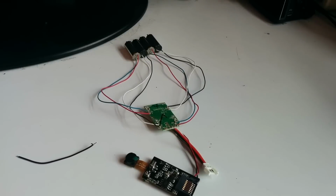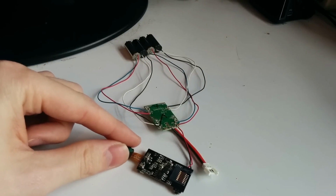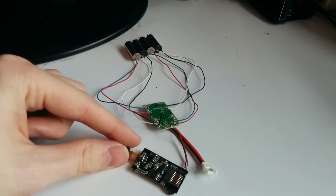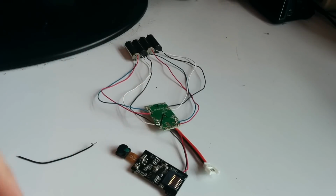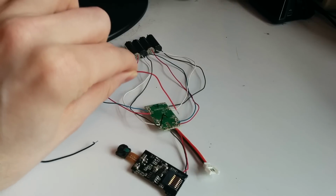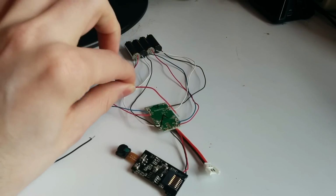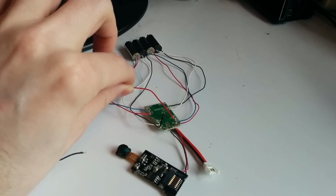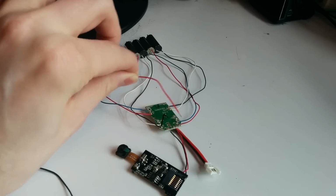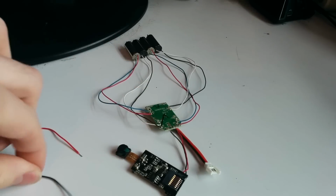Now here is where it gets a bit challenging. My next task is to solder the 2 megapixel camera and tap into the power of the Hubsan controller. But also, to power the VTX, we're going to need another wire coming off this, going this way, towards the regulator. So my hope is to put a blob of solder on here, and then very quickly attach these two without bridging this, and then do the same with the negative wire.